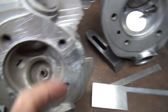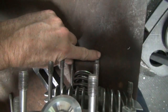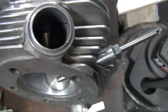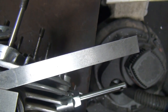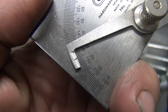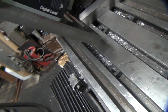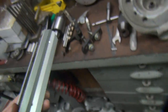I'm going to figure out my angle to cut this plug at, because I wasn't happy with how it came out before. Basically I'm squaring the head up, coming off these two studs, sitting flat on the table, so the head's going straight up and down. I look at my spark plug angle, take my angle finder and lay it flat against the head gasket surface, eyeball my straight edge. That looks pretty much the same angle. You come over here and read the angle — it's 65 degrees, which is 25 minus 90 is 65. So I've got my angle plate set at 65 degrees now.